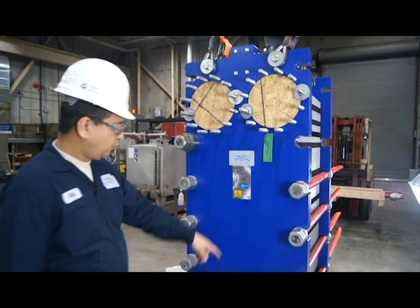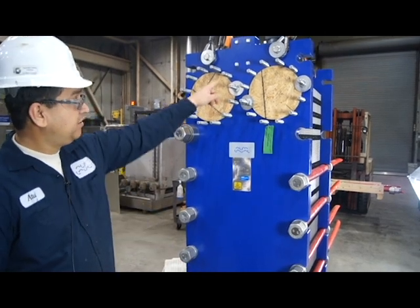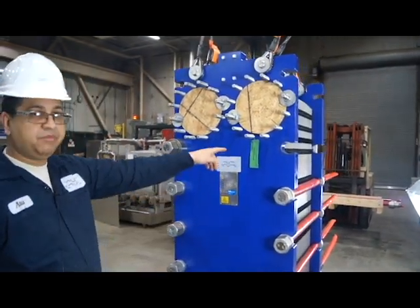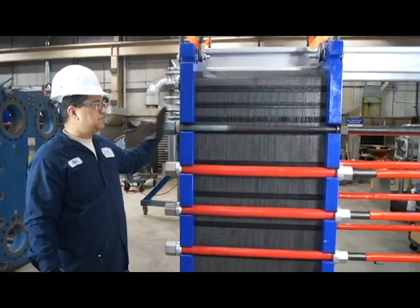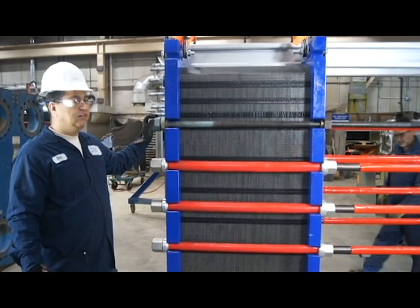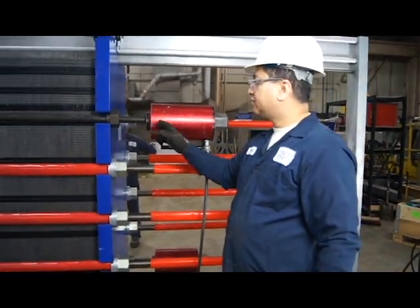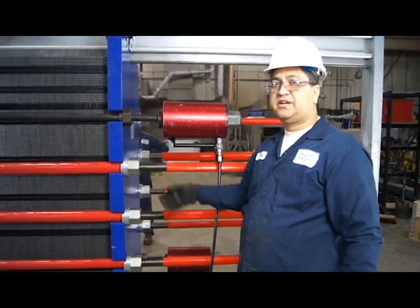Right now we've taken out four small bolts which are 46 millimeter — 1, 2, 3, 4 — and also taken out two 80 millimeter diagonal rods to add up the hydraulic. We installed two extra rods back and we're gonna install the hydraulic cylinder in it. We're gonna open the cylinder up so the cylinder will take all the load, and we're gonna remove the bolts after.